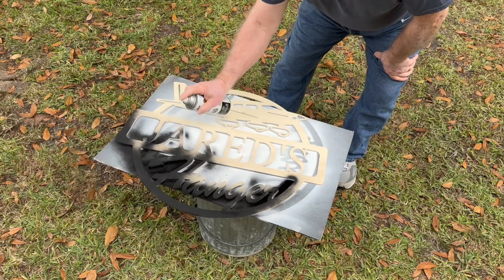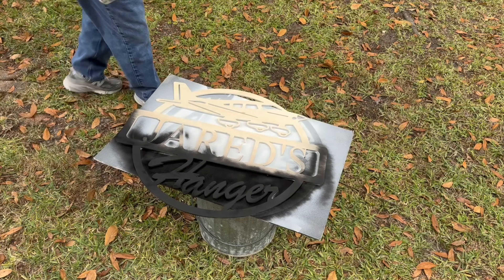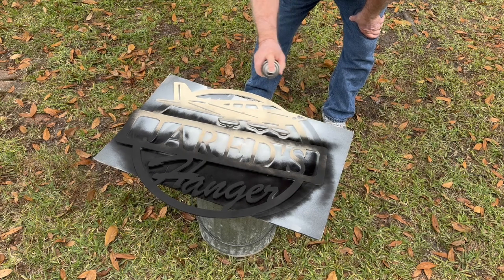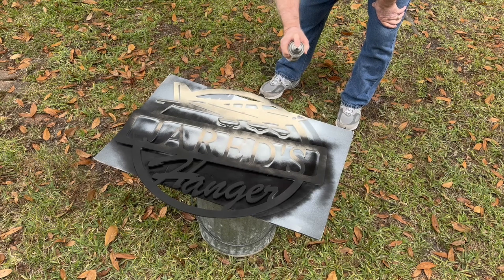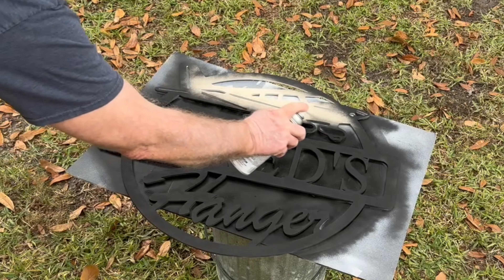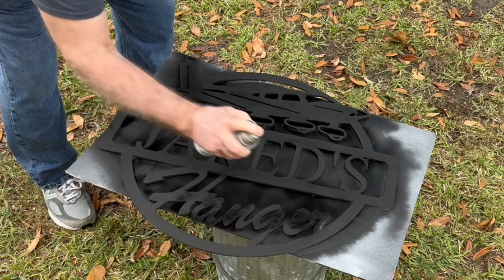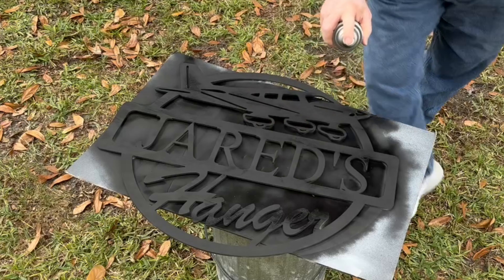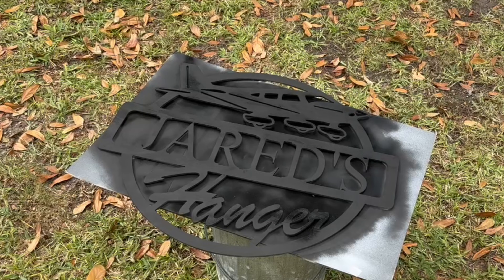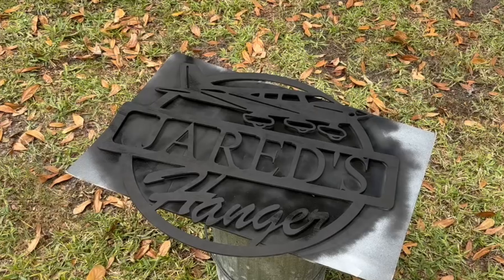Once the white is dry, it's time to switch to the front side. I'm putting two coats of black primer on the front. I like to do the edges first — there are a lot of edges to paint black, and by doing the edges first you get the bulk of the surface as well. Once the black primer is completely dry, I'll sand it well because it will raise the grain, then spray paint it black gloss. It's up to you whether you use gloss or satin, but don't use just flat black primer — that's only for the undercoat. The black primer seals the wood and gives a good foundation for the top coat.